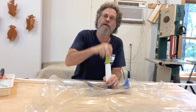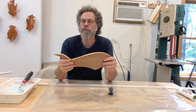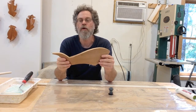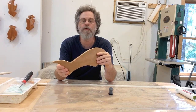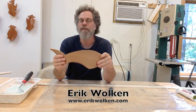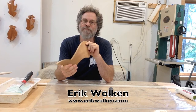It's been two hours and we've removed our fish from the vacuum press and removed the blue tape. You can see we've got a really nice, pleasant organic shape — this fish is definitely ready to take a swim. What we need to do now is the final shaping, probably with some pattern maker's rasp and sandpaper to clean it up. I'll put a little eye here as I've done in my other fish, and then we'll apply some oil or lacquer. This is basically a nice little intro to what you can do with freeform bending in a vacuum press. Thanks for watching.